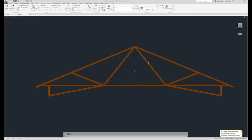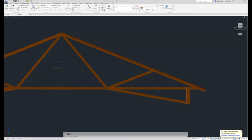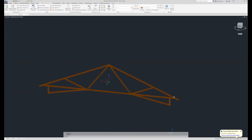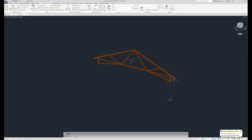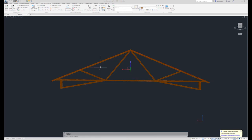So again, this becomes my fixture or my jig, and I lay my other parts on top using flat bar and clamps, and I build my other 4 trusses, and then I add my accessory piece, which is my shear tab on each side, tack that, and lastly I add these 2 angles on each side. And what these are for, this is what we attach the 2x8 nailers to with screws from underneath. So that would probably make the most sense in how to assemble this in the shop, which I need to make sure that I have all the correct dimensions for the fabricator in whichever direction he decides to put this together.